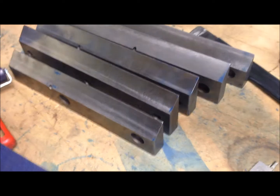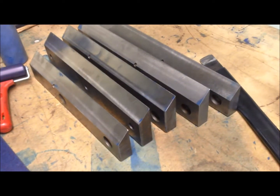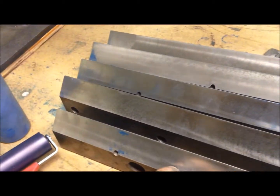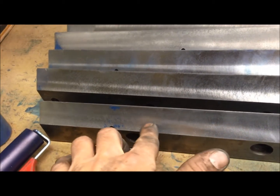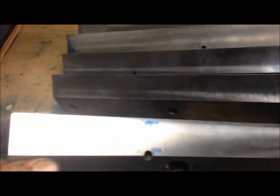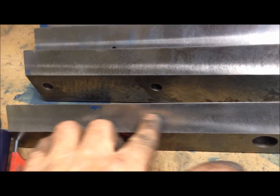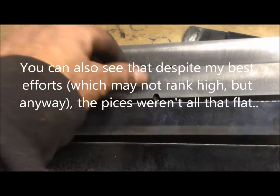Finished, now milling five test pieces, and it seems to function okay. I ran the milling cutter, the face cutter, rather fast, doing climb milling, and that produced a very smooth surface, almost like grinding. So I'm rather pleased.